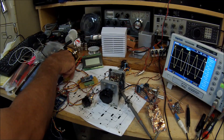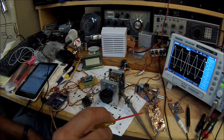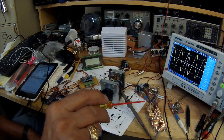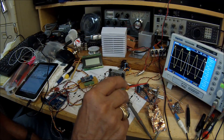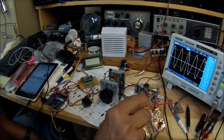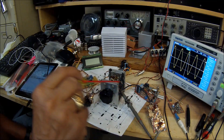What is really important about this article is the "Let's Build Something" philosophy — so many projects today are so complex that the newbie builder gets overwhelmed. Here we have a double balanced mixer with just four diodes and two ferrite core transformers, a total of four transistors in the audio amplifier stage which will produce several watts of audio amplification, and a single transistor RF amplifier ahead of the double balanced mixer.